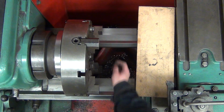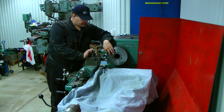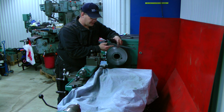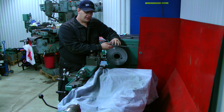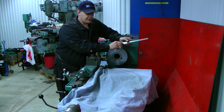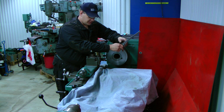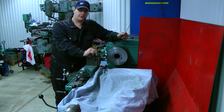No. And as you can see, I have been measuring this diameter with an ordinary caliper, and normally a caliper only measures tenths of millimeters. So if the precision you're aiming at is tenths of a millimeter, then it's okay with the caliper. And if you need to shoot at a 100th of a millimeter, then you need a micrometer. And why do I not use a micrometer? Because I do not have one. So I get into position with my caliper, and as you see, I'm testing.